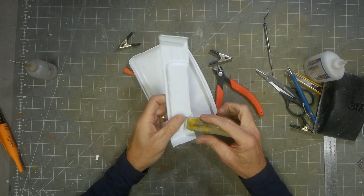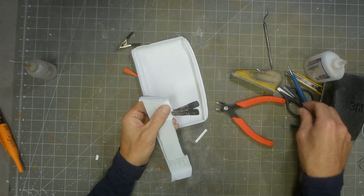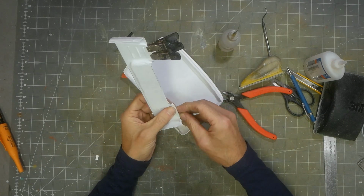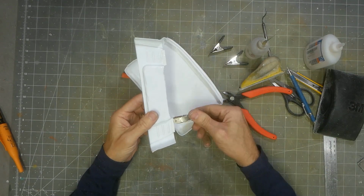The small styrene shapes are solvent glued along the edges. This is done after careful fitment of the pieces has been accomplished. Since this is solvent glue, the edges need to be touching as much as possible.